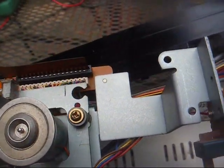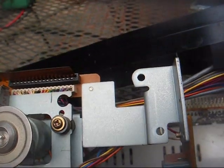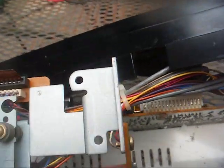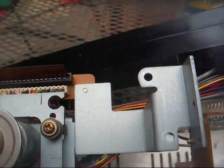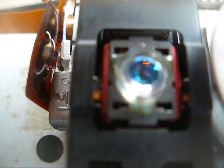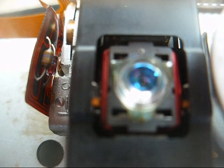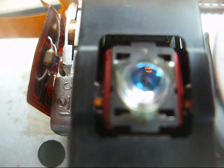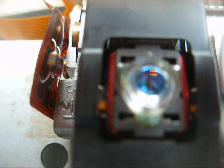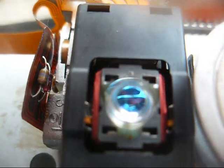Okay, here we are exposed again. The next thing we're going to do is take our ohm meter and check these switches here. This one here, and there's one on the front, on the plastic front, that we need to check. Okay, let's see if we can get anything out of this laser. A very little bit. As you can see, when I close the switch here, I see a little illumination, but not much. Really need to get this in a darkened area to really check it.